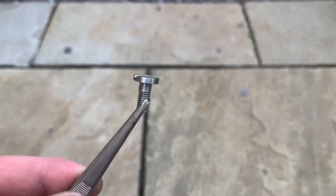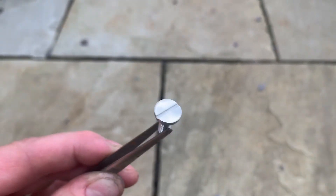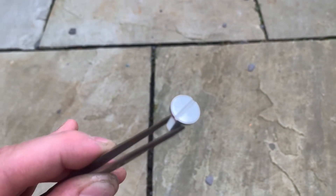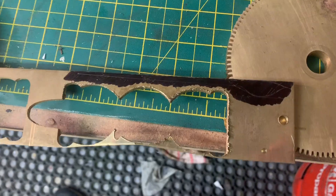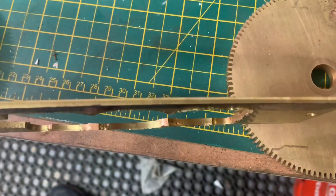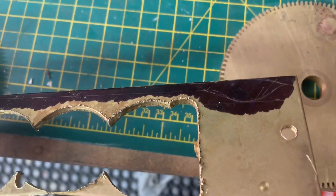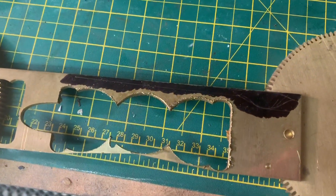I'm really pleased with that - it polished up well. I did the final polish off camera using the back of the sandpaper, so it's literally just like using a sheet of paper. This is the click spring - it's going to be cut from roughly four mil, just under actually, three and a half mil brass, cut from flat and then bent round to form the spring.